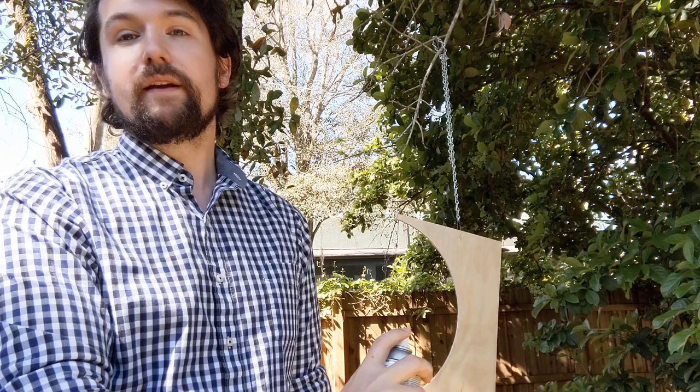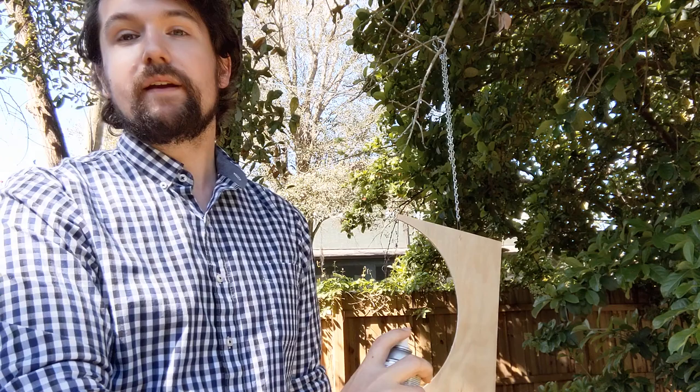I hope you learned something here. The most important things: spray paint always outside; start your spray paint flow off of the workpiece; keep it about 10 to 12 inches away; and go nice and steady, releasing pressure only after you've passed the end of the workpiece. If you're building the guitar with us, make sure you practice on some scrap wood like we just did, and then we'll try it on the guitar next week for the final installment of our video series. Thanks so much, have a fantastic weekend, and we'll see you guys later.